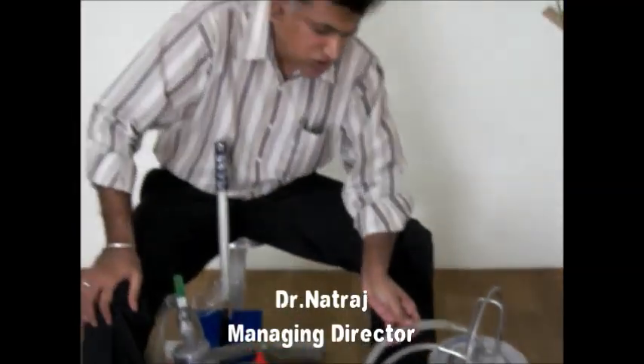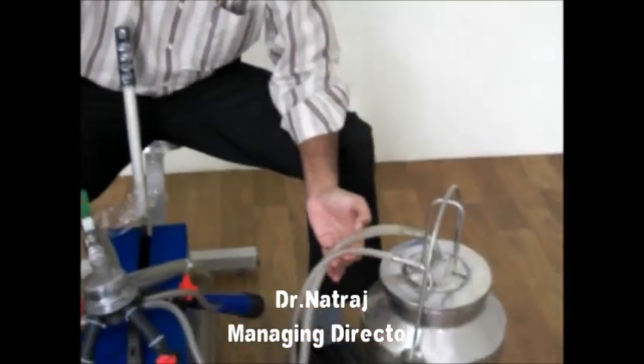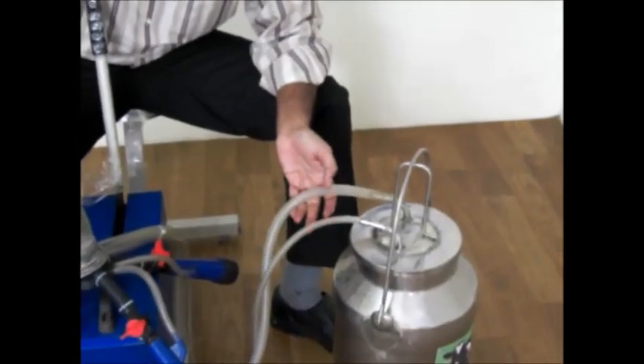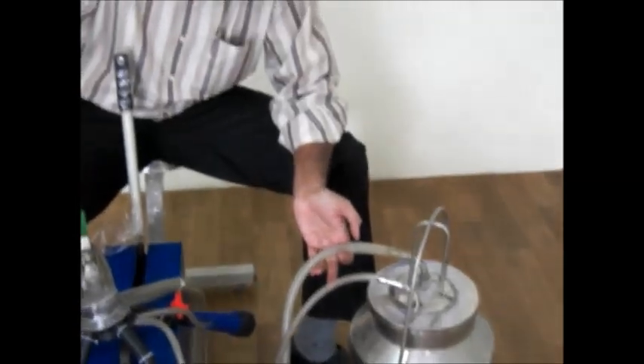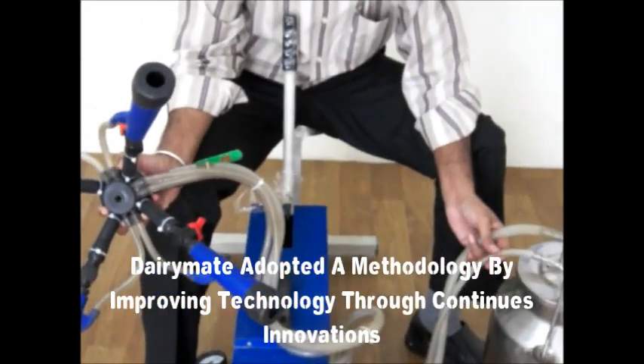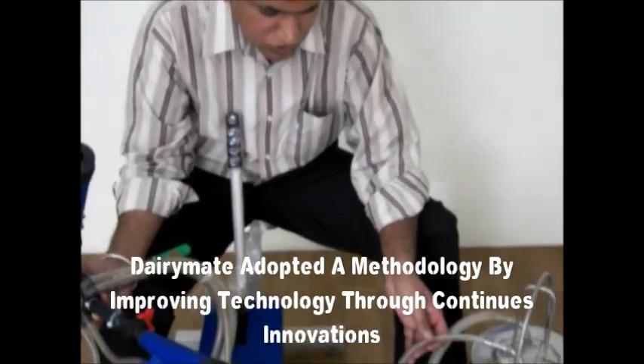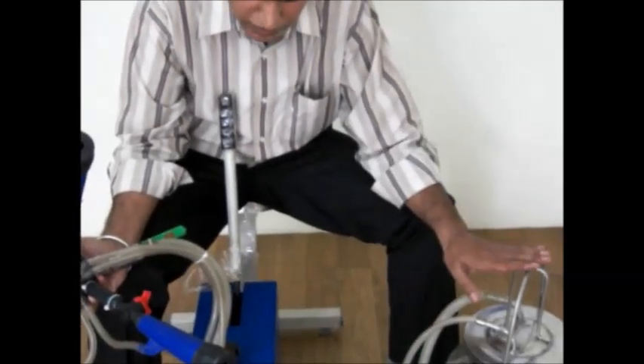This can is connected with a hose. We have a big hose and also a small hose. The big hose is to transport the milk from the cow through the cluster, and the small hose is basically to transport the air to build a vacuum into the can.